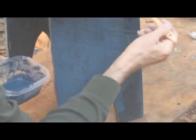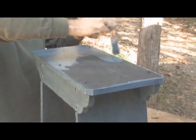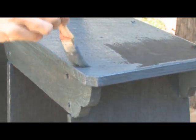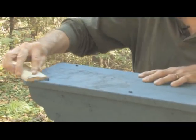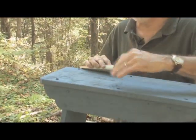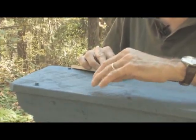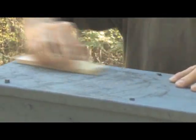Again, you want to be careful to cover the deeper recesses of the grain and texture. Use fine sandpaper to lightly sand the second coat after it dries. To sand through the top layer reveals not only the color beneath, but also some of the wood grain beneath that — it actually gives a three-color finish.